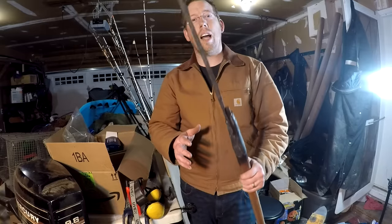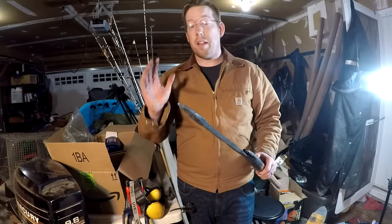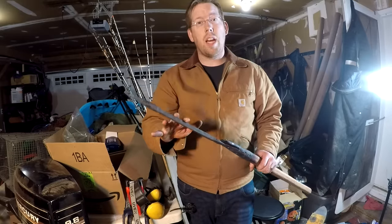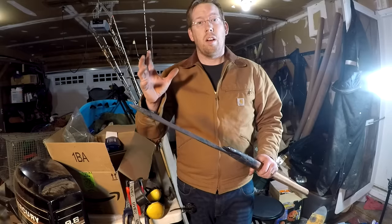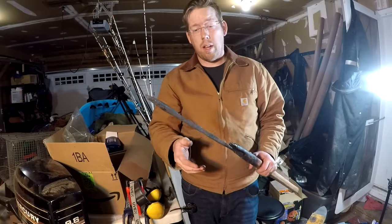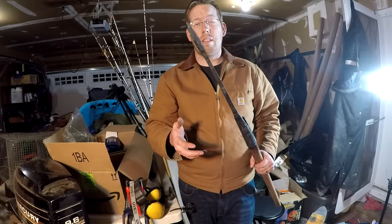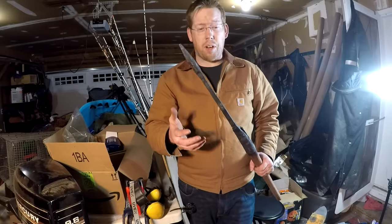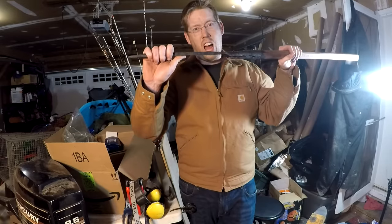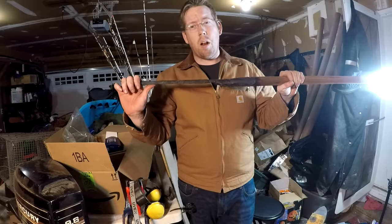Now, a lot of you guys may be at home going, oh, you didn't heat treat it. Yeah, that's absolutely right. I did not heat treat this. Heat treating is to make something harder, but it also makes it more brittle. And this is a javelin. It's not a razor, it's a javelin. And when this thing sticks into something, it puts a lot of force on this, especially right here at the neck. And I don't want it snapping.